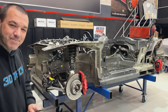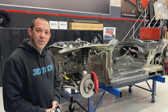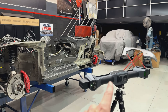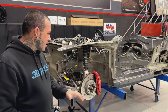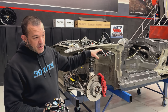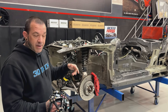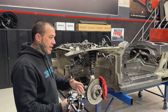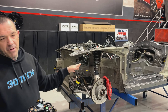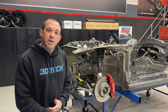Adam, we're going to 3D scan this thing. You've got all this beautiful gear here and this handpiece — just give us a rundown on what's going on and how it all works. So we've got some markers out to 3D scan the car and the other body. The tracker will follow the markers around, the handpiece is followed by the tracker, and that'll capture all the data of the car. We'll be able to overlay the two cars and see where things need to be cut, shaped, and modified.